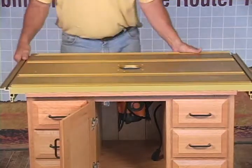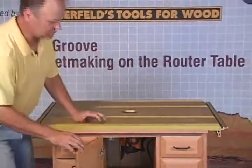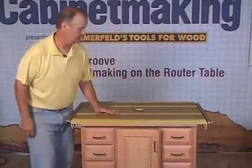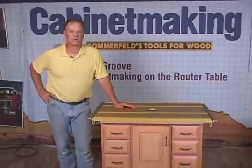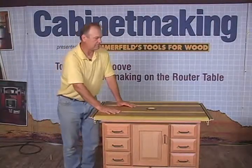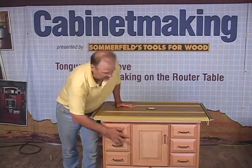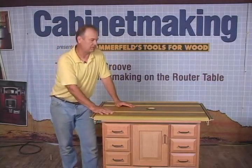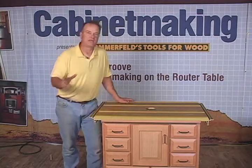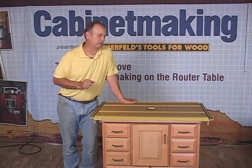There, the 4 bolts are down underneath there. Now you can take some washers, run underneath there and lock that down, and you're in business. So that's the completion of our building of our router table cabinet and our router table top and fence. That is one way you can do it with the cabinet. The other place you can use this is, like we said in the beginning, you can install this whole router table into the table side of your table saw. And we'll give you an example of what that looks like next.